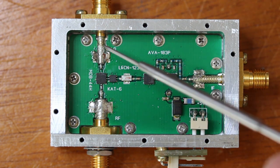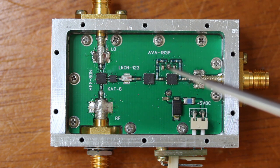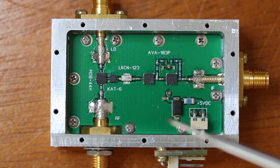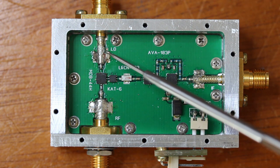On the other side is the 15 GHz plus 15 GHz local oscillator input, and I used here an 18 GHz Amphenol connector, together with a length of semi-flexible RG405 cable.